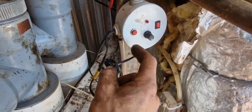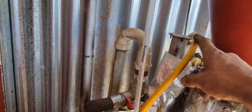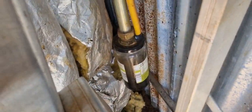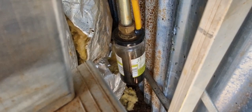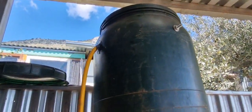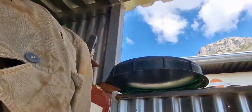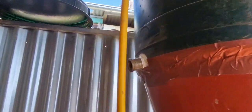The intensity I can tune here, along with an on/off switch, power indicator, and override button. It measures the pressure difference between the cyclone — inserted in the glass catching can of the cyclone, which catches some moisture and mostly dust or pieces of char — and the hopper itself, which is airtight with this sealed lid.